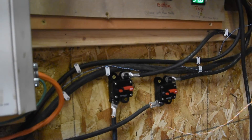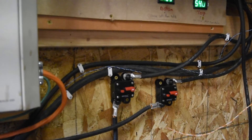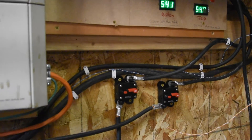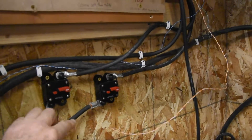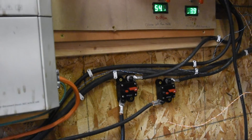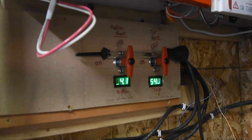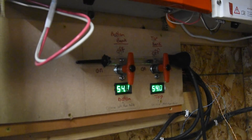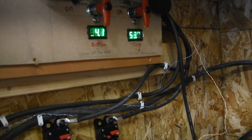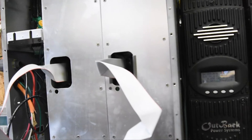Recently I've read some disturbing news that these breakers may not be as good as they claim — they may not trip at 250 amps. Even though I bought this from Missouri Wind and Solar, I'm hoping they're good, but just to be safe I've ordered some regular one-time fuses to put in addition. These disconnect switches I have here are from Harbor Freight, rated for 200 amps and supposed to disintegrate. But since you can't be sure, I'm going to put another safety fuse right here just to protect from back-feed, because this is an 8,000 watt unit and I don't want to damage my batteries.